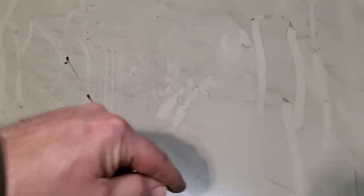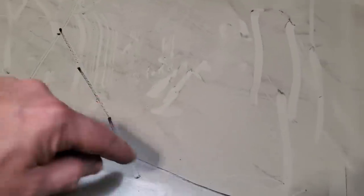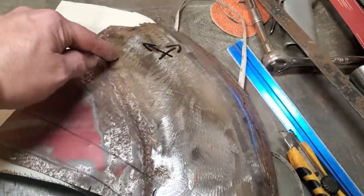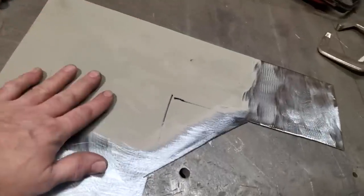By cutting this piece out here, now I haven't got to worry about doing fancy rolls. I just got to roll this way with a slight crown. I got to roll this way with a slight crown, okay? And then I'll just turn around and cut this in through here, and that will weld on through here, up through here, and across here. I'm keeping this section here, see? So I'll go cut that out now. I went ahead and cut out the piece of steel.